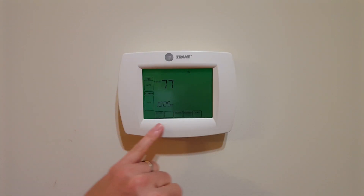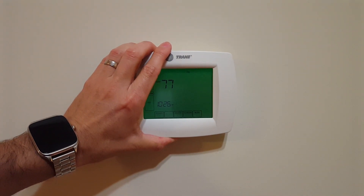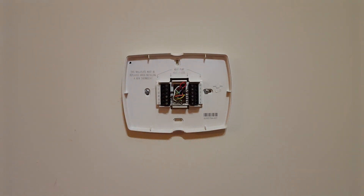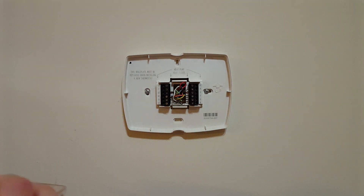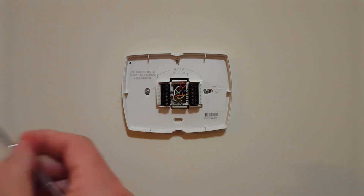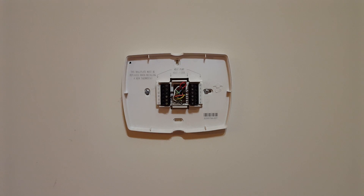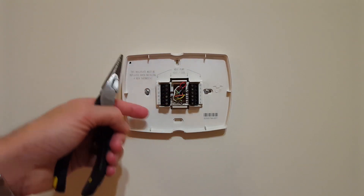This unit is battery powered, so it still lights up on touch, but there's no power now. I'm going to peel this off the wall — be gentle with these, they're not always so easily removable. A couple things first: before I did anything else, I would advise you to go get the right tools, like a pair of needle nose pliers and some fine-sized screwdrivers — in particular fine flat heads that fit for the uninstallation. I would also highly recommend you very clearly take a picture of how your wires are connected in the previous bracket.